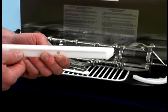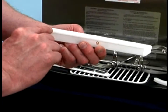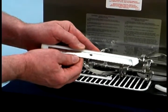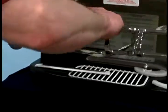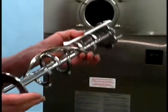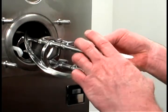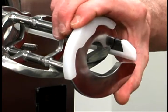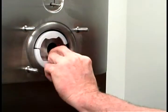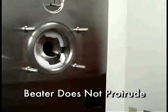Next, install the beater assembly. Look closely at the scraper blades. If the blades are nicked or worn, replace both blades. If the blades are in good condition, install the scraper blade clips on the scraper blades and place the rear scraper blade over the rear holding pin on the beater. The hole in the scraper blade must fit securely over the pin to prevent costly damage. Holding the rear blade on the beater, slide it halfway into the freezing cylinder. Install the front scraper blade over the front holding pin. Install the beater shoes and then slide the beater assembly the rest of the way into the freezing cylinder. Make sure the beater assembly is in position over the drive shaft and that it is properly seated. When in the correct position, the beater will not protrude beyond the front of the freezing cylinder.